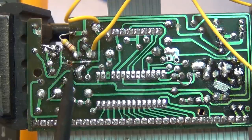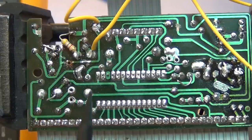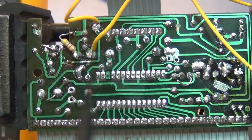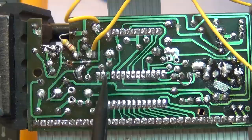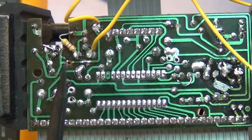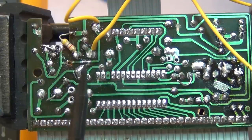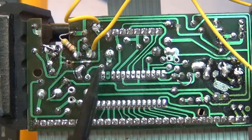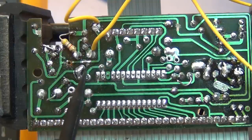We've cut a few things out here. We've taken a Zener diode out that we didn't need in this place. We've taken the capacitor out here that we didn't need anymore, because that wasn't going to allow our pulsing alarm signal to get through. But it will now. Then we basically just said, okay, we got a Zener going from the clock, or from the alarm pulsing signal over to here.